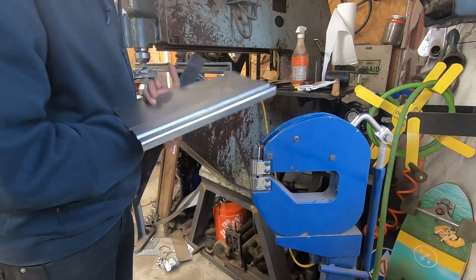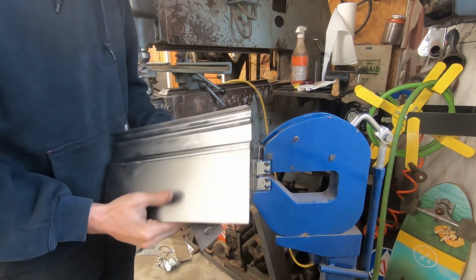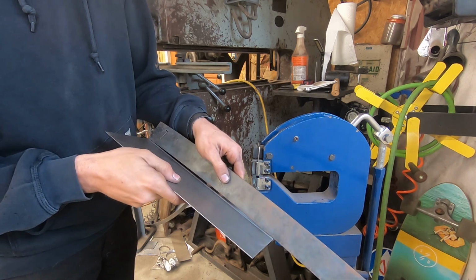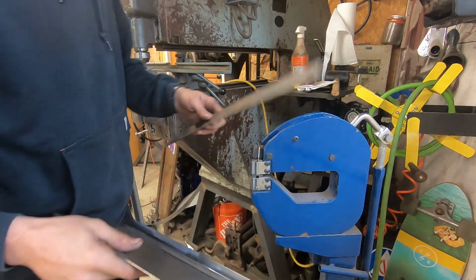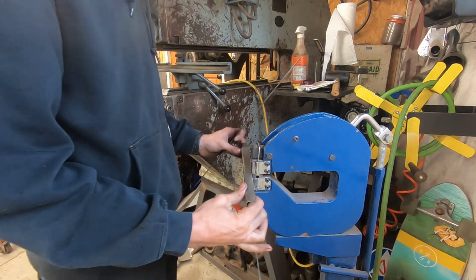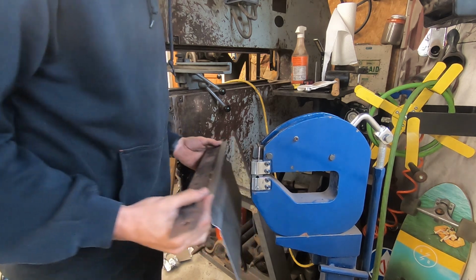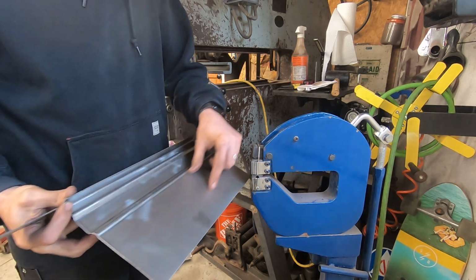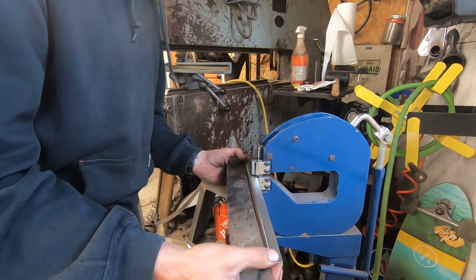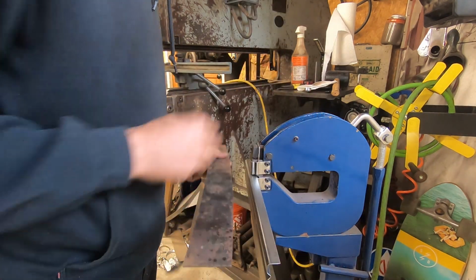Alright, it's cool that I made this flat and all, but the panel is not flat. We just tested it towards the bottom where these patches are going. It's a 7 on my radius gauges from Imperial Wheeling Machines. So I'm going to stretch this edge, hopefully get it to the 7 that I'm looking for. And then if I need to linear stretch this, I'll do that. So here we go. No, I need to, yes, I need to, because it's this side. So it goes like this.